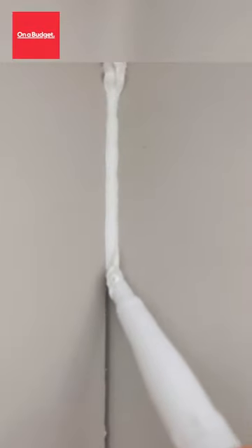Because my ceiling is not straight. And for me, this is really satisfying because I just love smoothing it out and getting it right in there. Top tip when caulking is to spray it with some water with some washing-up liquid in — it makes it so much easier to smooth out.